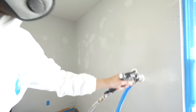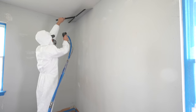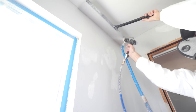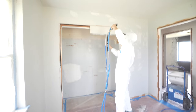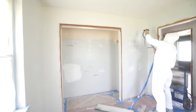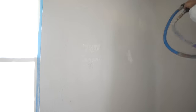The next couple of rooms have dark paint where the spray is going to be more noticeable, but I want to talk about a few best practices. First, you want to keep your spray gun parallel to the wall — don't point down to the floor or up at the ceiling too much. Beyond that, go in an up-and-down and then side-to-side pattern to prevent yourself from seeing your lines too much. For orange peel texture, hold the gun at least 12 inches away from the wall to get a good spread, but you can hold it back as far as three feet to get the desired texture. I'm going in tiny little spirals — whatever you can do to break up patterns is what we're going for.